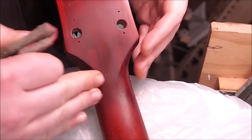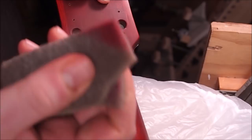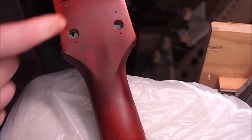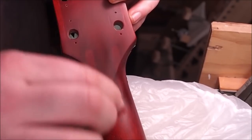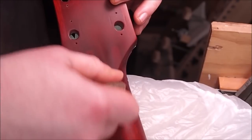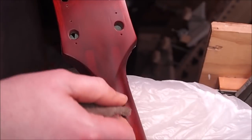With the color coats on here, you can see we came pretty close. It's a little bit darker, which we expected - that's one of the reasons I shot two thin coats of clear lacquer on here first. What that lets me do is take an abrasive pad or 600 grit sandpaper and come back and abrade back a little ways to that clear lacquer, softening the transition line between the repair and the original color of the headstock. It creates sort of a gradient effect rather than a hard line, and it just looks better. After this, I'll shoot three thin lacquer coats, let that dry for a day, sand it back level, put two more coats on, and then I'll be ready for final leveling and polishing.